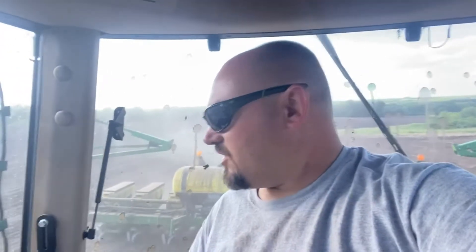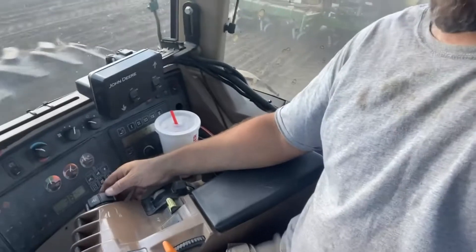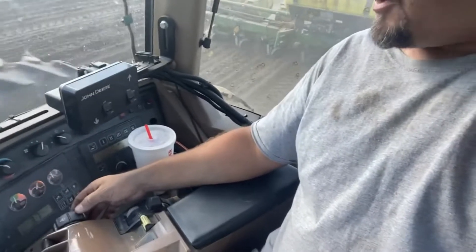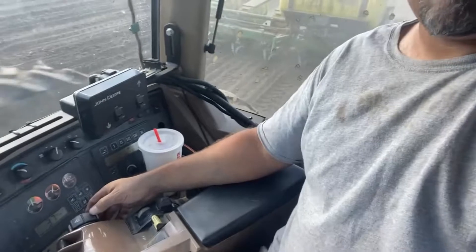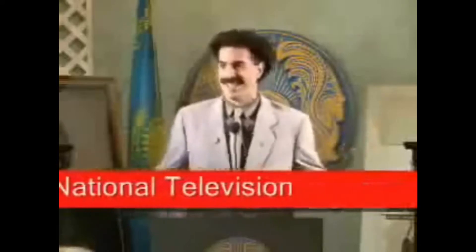It does adjust quite a bit, so as long as I'm in my rows with the row cultivator, it shouldn't be a problem - because 12-row planter, 6-row row cultivator shouldn't be an issue. Here's when I want to take off the autosteer - I just flip that down, make my turn after I raise up the implement, just like this. How's that for one-handed? So nice. High five. So I hit it again, picks up my steering path, and I just set down the implement.